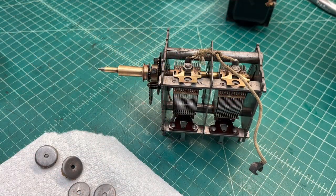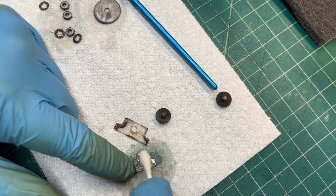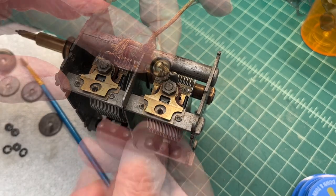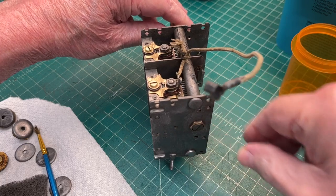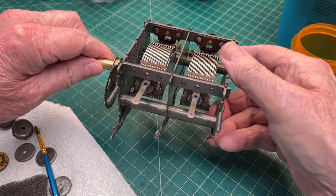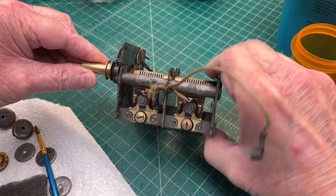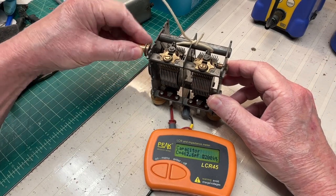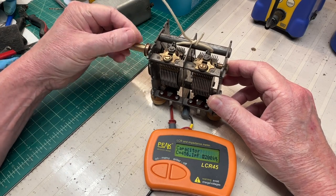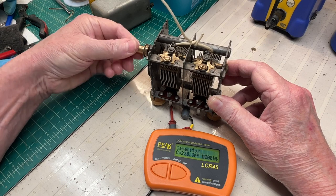As you guys probably noticed, I left the lead wire from the antenna section that runs back over to the — I believe it's the 6A8. I'm going to look at the tuning condenser from different angles. One thing left to do would just be the lead wire dress over to the antenna and the gimmick capacitor from the oscillator section. It cleaned up pretty well considering my starting point. Everything checked well between the stator and rotors — no DC resistance — and just rotating it through to look at capacitance per section. Thanks for watching, folks. More updates to come as time permits.